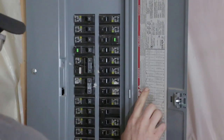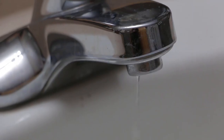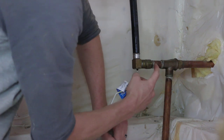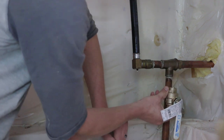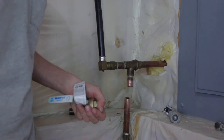First we're going to cut power to the well, turn on some faucets to drain out water, then cut in and solder things in. I'd really recommend filling up a couple pitchers of water just in case things are down for a while. After taking a closer look at the ball valve, I think I'll place it right here - being careful that when I'm heating things up I'm not too close to the existing solder points.